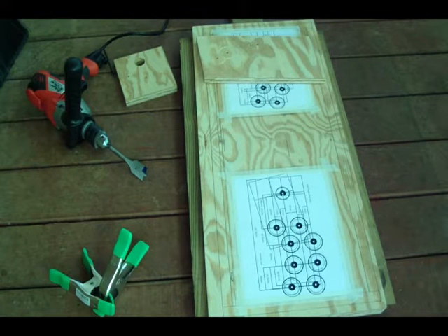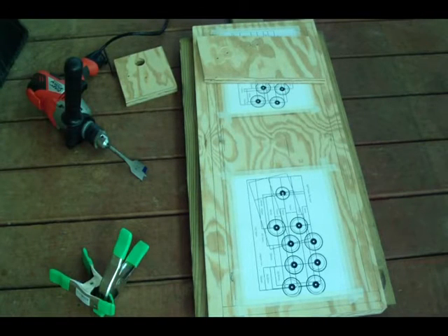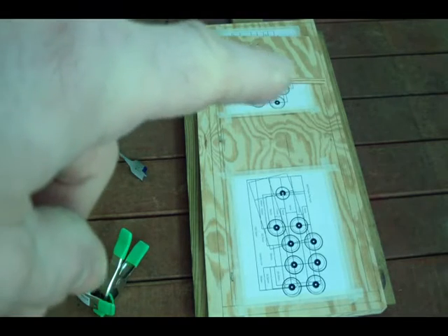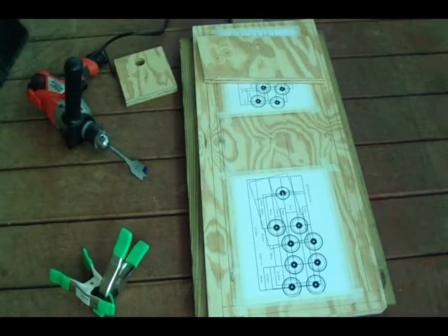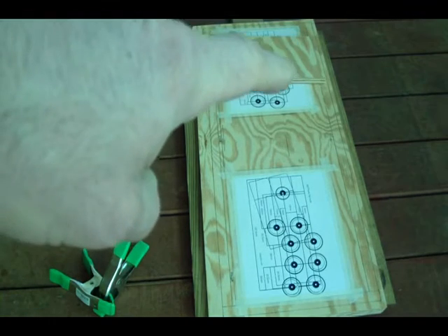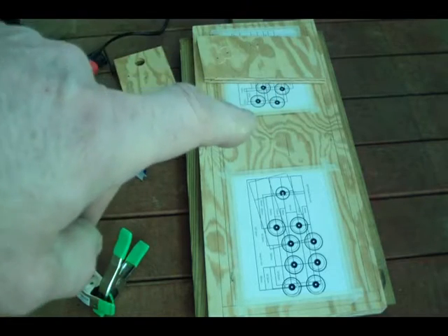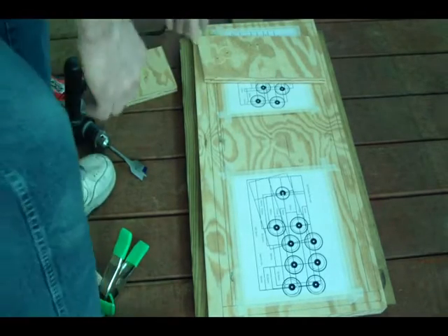I've got a temporary setup out here. I need room on both sides for my clamps. The first thing I need to do is take that larger scrap piece and use it as my guide. I want to drill one or two holes near the center of it, offset slightly, to use as my guides. I apologize for what you hear — sounds like a neighbor's putting a fence up. I want to put one hole a little closer to this end and one a little closer to the other end, so I don't have to move the guide board so high or low that my clamps won't reach to clamp it onto the control panel top.